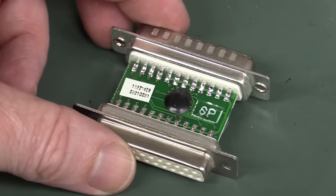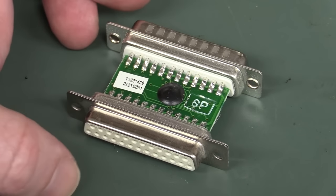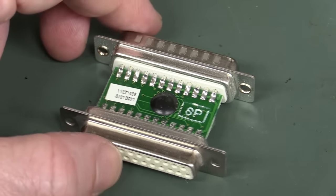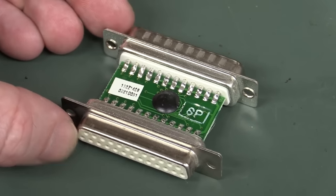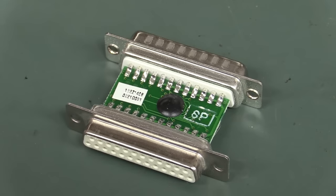A common technique was just to use, you know, basically jelly bean logic, shift registers and stuff like that, and you can just encode the data, and then you potted the thing, and yeah, you could reverse engineer it, but most people didn't bother. There was no internet back then, so people couldn't just commonly share the knowledge if you did reverse engineer it. So, just a simple jelly bean logic way of doing it, just shifting out some hidden bits or something. If the correct bits didn't come out, then, boom, that was it. The software just wouldn't work.